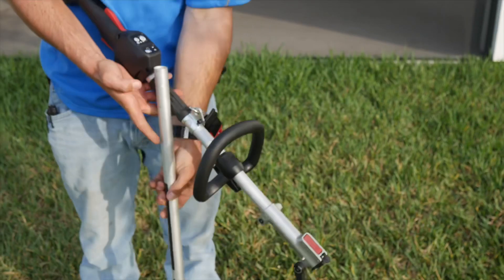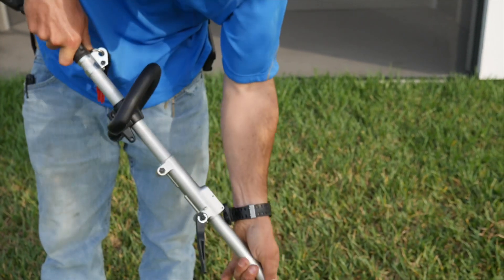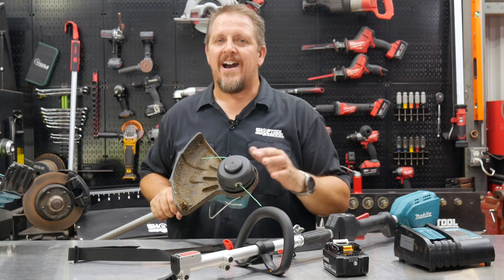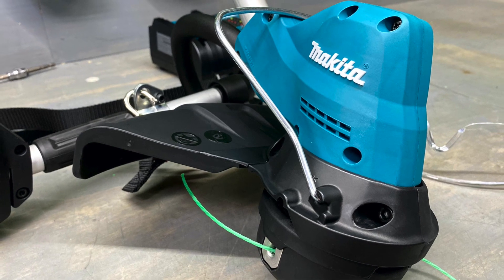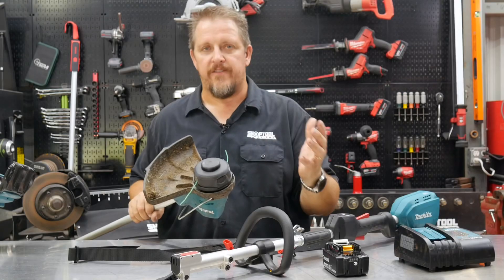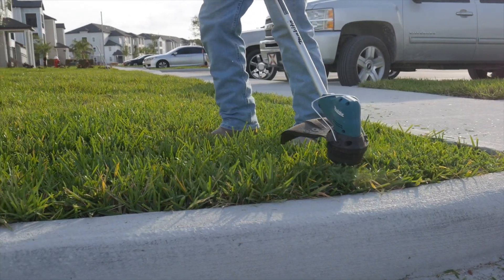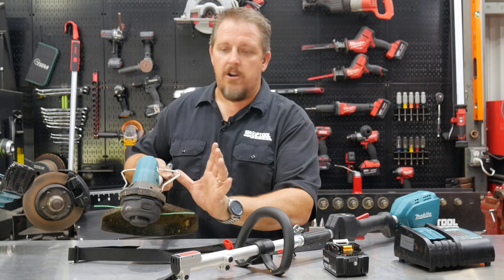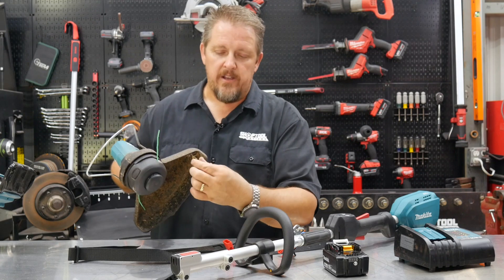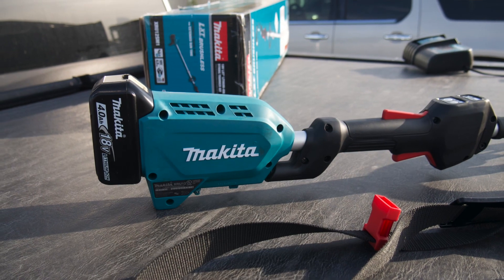The head itself — as you can see, you can actually attach other units to this as well. It comes with the string trimmer head and 0.080 line. They say you can run up to 0.095, but I'd say 0.095 might drag a little — it's made very well for 0.080 to 0.090. It's a bump-style head, so it auto-feeds as you bump the head. It's also very easy to load. The weed guard flips out so you're bumping against a fence or whatever you need, and as line feeds out it cuts automatically on the little knife on the head.